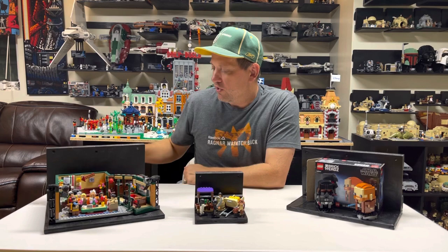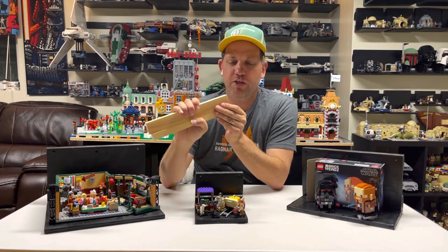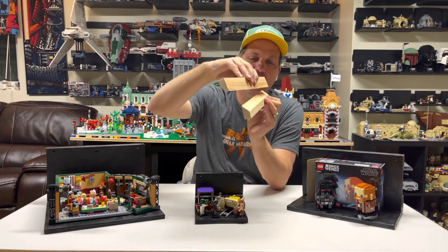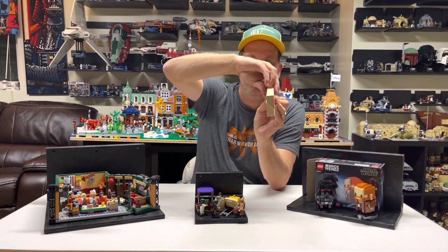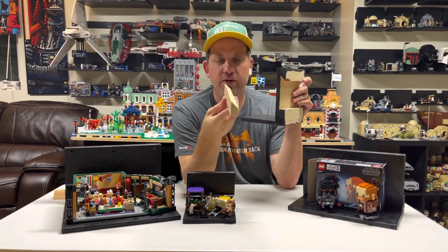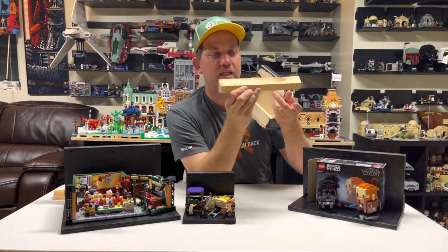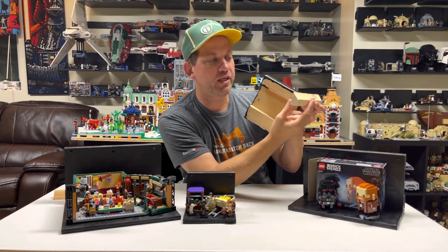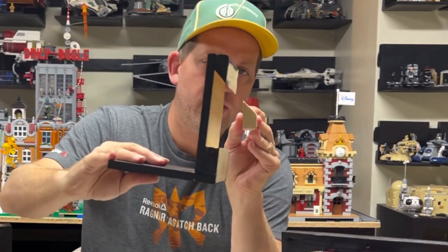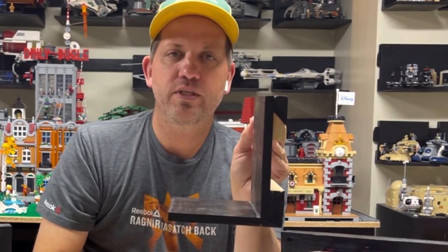So the way that the French cleat works, the key piece is the back top piece of the shelving unit. I started with a 1x4, and you cut that into two pieces at a 45 degree angle, and that creates a wedge where the shelf just fits in there snugly. When you take that 1x4 and cut it about halfway down at a 45 degree angle, you're left with two pieces. One will be attached to the shelf, the other will be attached to the wall. Again, it will be this short side that will be attached to the wall, and this is the part where the shelf will rest. So when that's there, the shelf will just come and rest just like that. And it's mostly gravity and that groove that holds it into place.